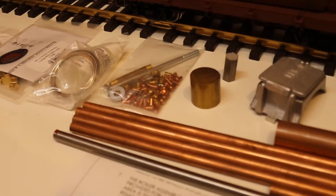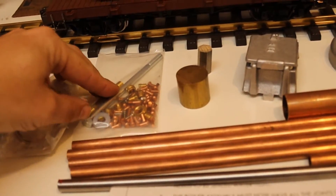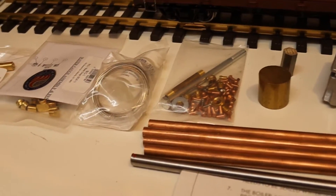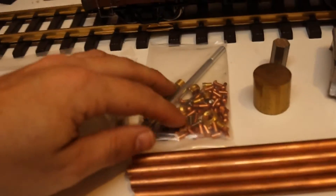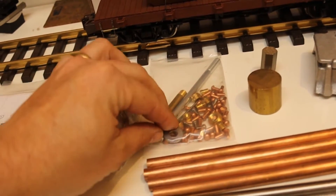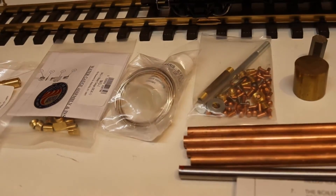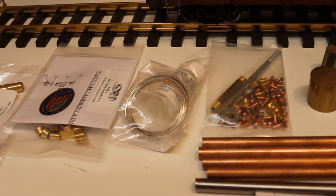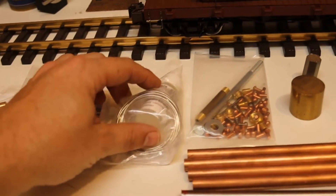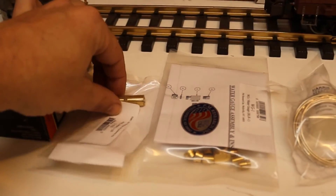Making all your own tools. It also comes with a tool for expanding the tubes, which I was a little worried about, but I was really pleased to see that they had included that with the kit. Also, oftentimes the fittings — I thought I'd have to set a two-degree taper for doing all my pipe fittings — but they actually came with all the pipe fittings that you silver solder on for the steam output, the water input, and the water gauge. They give you the right silver solder that it was engineered for, and most importantly, the pressure relief valve set to 60 PSI.